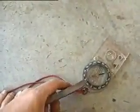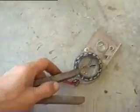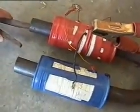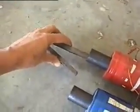I've got a battery clip on the positive there and I'm going to use this one to tap on here to charge up the magnet. First of all, I'll check the polarity of the magnet and I want the south pole. So that's the south pole there. I'll put that over here like that and we'll tap the electromagnet and charge up the V-shaped magnet.